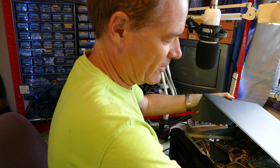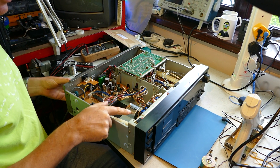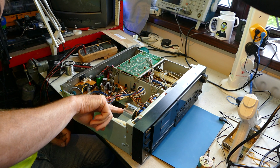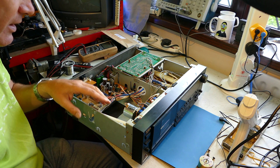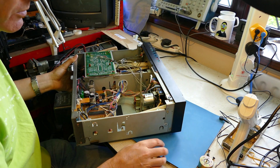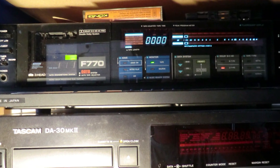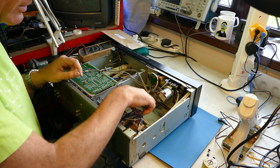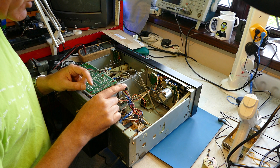Let's have a look inside. I've already marked up what the wiring was on the motor. This motor part number is XMI6B2HL - there are other motors which do essentially the same job. The great thing about this particular deck is that, unlike some other AIWA machines that use the same or essentially the same deck such as the ADF770, on this one there's plenty of space behind the deck and it's not too hard to get to the motor without removing the entire front. The F770 is a much harder machine to work on.